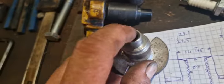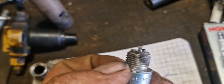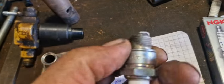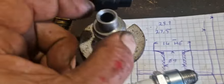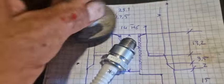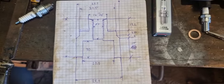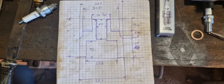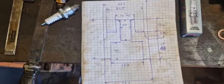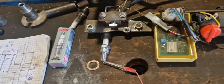This might help prevent this kind of stuff, because the threads were not touching anything, they were just hanging in the shell, because this thread is also 40 millimeters. This is exactly 40 millimeters in the engine, and this is the sketch of it for this particular Hatz diesel engine. 13 horsepower if I remember correctly on diesel, so I have about 10 horsepower on syngas, I hope.